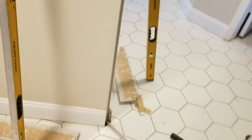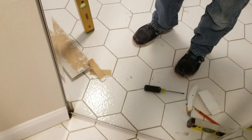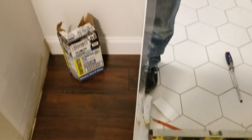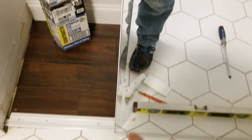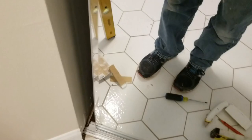The other door on the right side we still have to adjust just a little more, but we've made this door pretty close to level with the frame. So this is what you have to deal with — you're playing this game of adjusting those wheels at the bottom to set the doors at a happy medium. No three sides are going to be completely happy, but my main concern is making sure the door still glides smoothly. If you make these doors too far out of level to satisfy the wall, you'll put too much stress on one of the wheels and it won't roll smoothly.